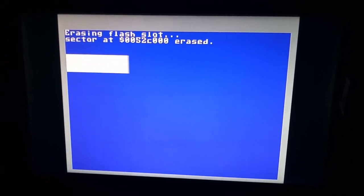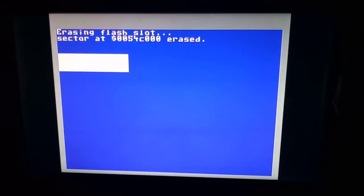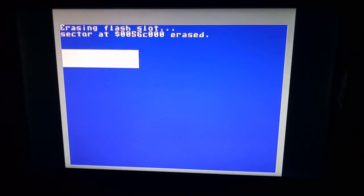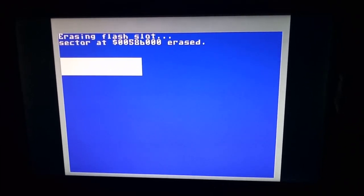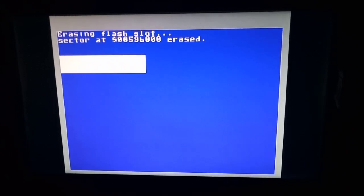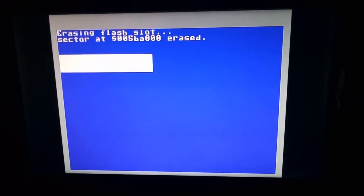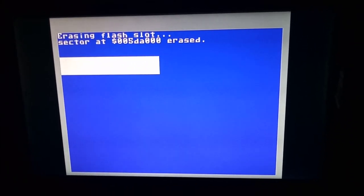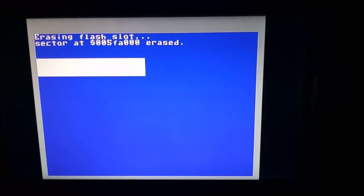And so the factory core has this menu and everything built in, and when you power on, it has a look to see if you've got something in slot one. If you have, then it will switch to the bitstream in slot one. There's some magic in the Xilinx FPGAs where the FPGA itself can feed itself the beginning of a bitstream that says, get the rest of the bitstream from this place in the flash memory. And so that's what we do.